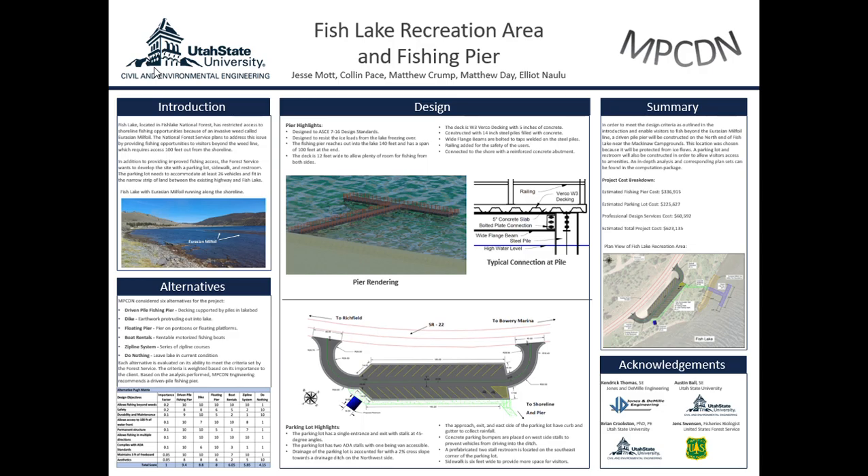The piles are connected with wide flange beams. We used a W16 by 31 across the portion that parallels the shore, and a W16 by 26 going from the shore to the portion that parallels the shore. The first number, 16, references the height of the beam, and the 26 or 31 references the weight of the beam per foot. We used a larger beam for the portion that parallels the shore as we had some larger spans and needed the increased strength over those distances.